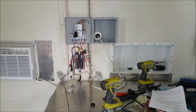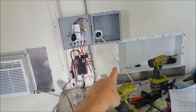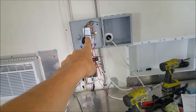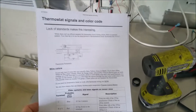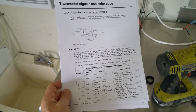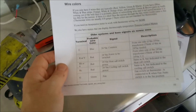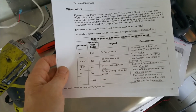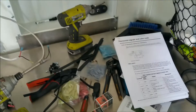I'm going to go through and clean all this up. This wire coming out from the penetration is the pump wire — you need to wire that into a relay. This is the speed and direction control for the exhaust fans. I'm going to wire the fans into the thermostat right here. I pulled this up off the internet — it describes all of the terminations on the thermostat I got. The relays are controlled by the batteries inside, so it doesn't matter what your common voltage is. On the reviews, a lot of people run this exact thermostat in their RVs, so it should work just fine.